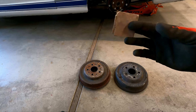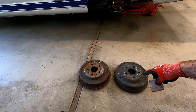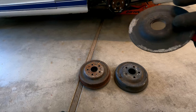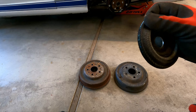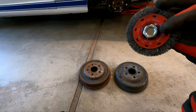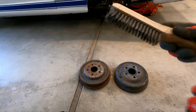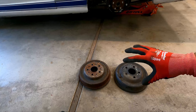We don't want rust on there because the paint won't stick to it. There are lots of different ways you can do it — you can use some sandpaper, here's some 220 grit, something coarse that'll get in there and get down to clean metal. You don't need to get this down to shiny metal, just get all the high rust off. You could use a grinding disc, though you might take more material than you want. There are also sanding pads and wire wheels. I'm going to use a powered wire brush wheel — it's fairly abrasive and can get all that high rust off. You can also use a heavy-duty hand wire brush. Don't forget your eye protection, and if you've got a respirator put that on too, because you don't want to breathe all the dust coming off of this.